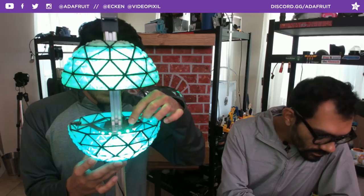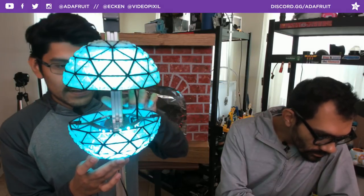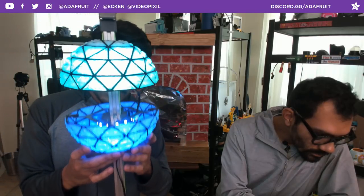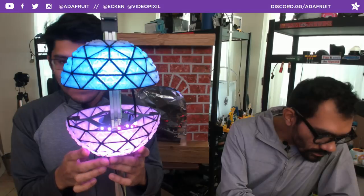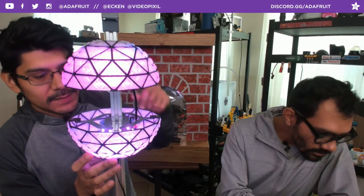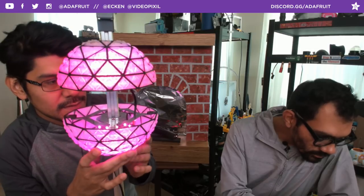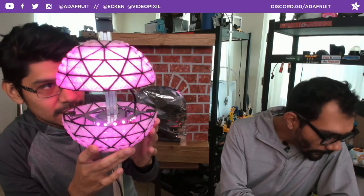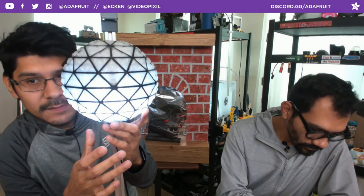Well, we're kind of making it. It's a slotted aluminum extrusion, so we are using those slots as little ways to create this kind of track. We got some NeoPixel strips wrapped around in there. These domes are dual extruded using transparent PLA and black PLA. And then we have those neodymium magnets on the inside that allow this to sit together.